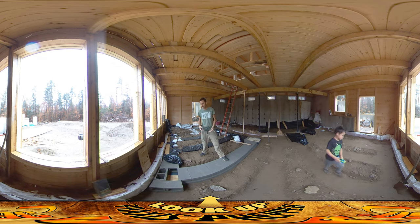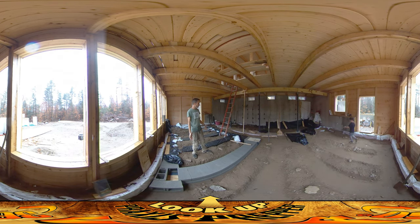We're making a lot of progress. As you can see, there are all these channels — I've mentioned them before. They're going to be subfloor tunnels where hot air from the upper levels of the house gets pumped in. It enters a hole in a junction box right here and starts fanning out through all of these tunnels, which are made out of cinder blocks. You can see a cinder block vertically right there, and these are cinder blocks all turned on their side, so there are two tunnels passing through each one.